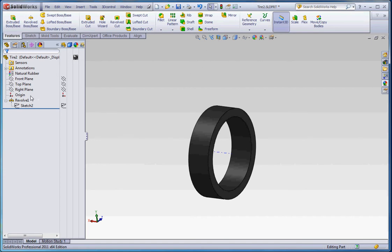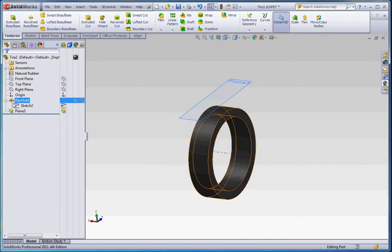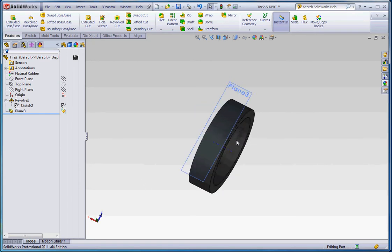What we're going to do is take the top plane and copy it up about 5 inches. I grab the top plane and move it with the Control key held down, which makes a copy. This brings up the dialog box giving references with the top plane parallel at 5 inches above, then click the green check mark. Don't forget to rename your features — I didn't here since this is just for demonstration.